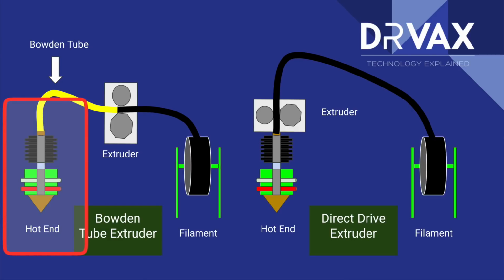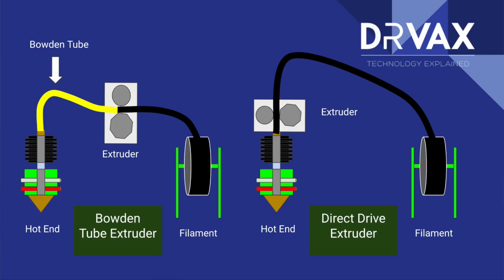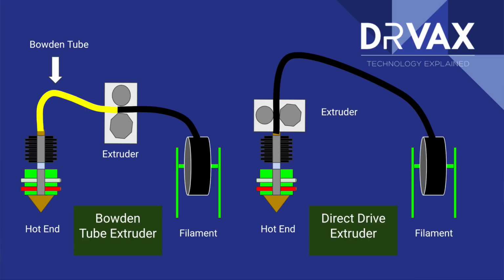into the hot end. Now let's look at that hot end a little bit. The green section of that hot end includes both a thermistor that will measure temperature and a heating element. And that's where the filament is actually softened or close to melting. That softened or melted filament is pushed into the nozzle. The black area with fins above the heating element is called the heat break. Because if we have soft or melted filament moving back into the Bowden tube, we won't be able to control extrusion properly. So you want the filament soft in the green area and below, and not soft above that.